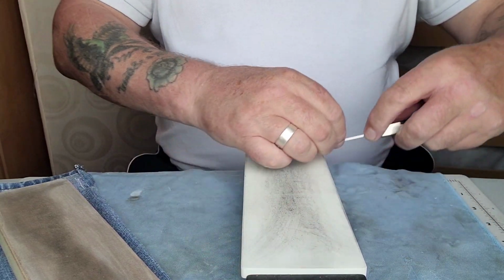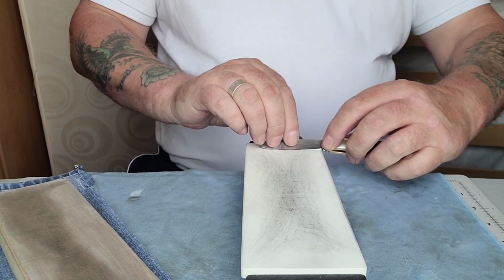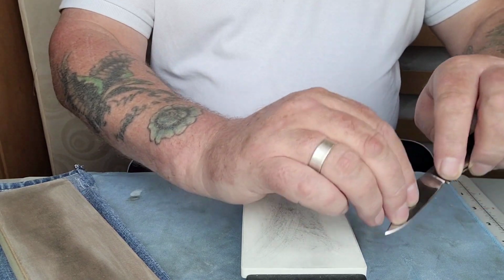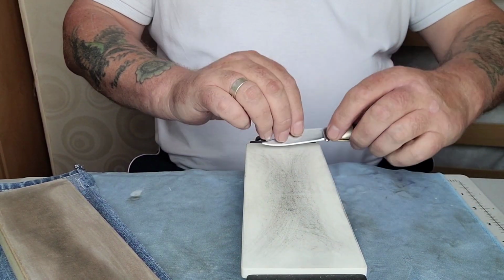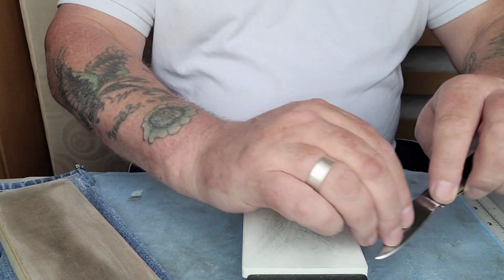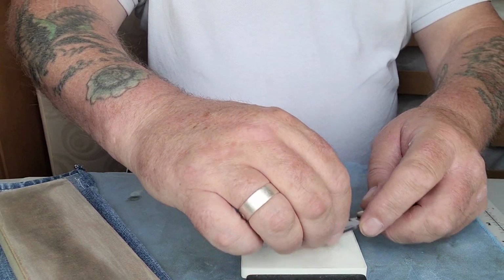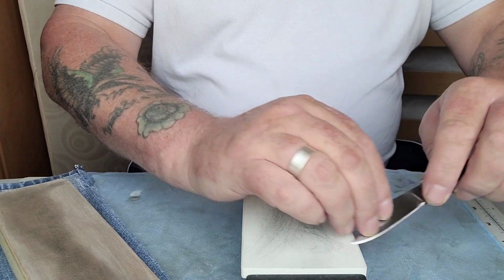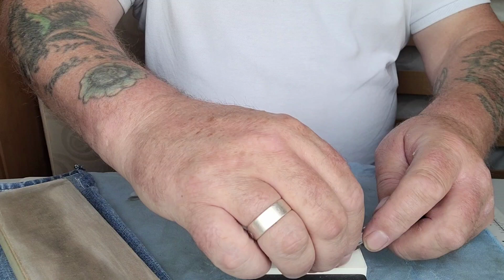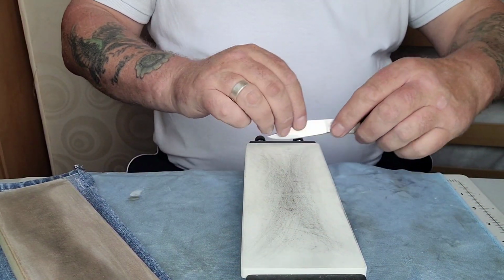Really, to get that back of mine done properly, I need to use a real heavy grit, like an 80 stone, and just really remove a lot of steel. That's what I don't want to do. Now this stone, if you keep on using, and just like I do, there's no weight I'm using here. I'm starting to hear no resistance, which means that I'm taking away the grind lines from the last stone, and this stone will put a mirror edge. If you keep going, it will put a mirror edge on your knife.